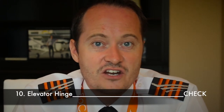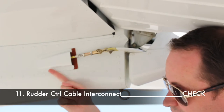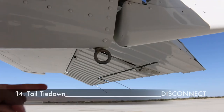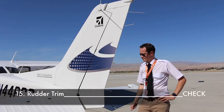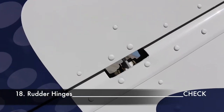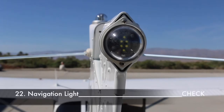Check the condition of the elevator hinge — verify a bolt and nut are present and the nut is secured. Look below the elevator to check the condition of the rudder control cable interconnect and the rudder and elevator steering horns; check for proper attachment of nuts and bolts. Ensure any tail tie down has been removed. Moving up the rudder, check the condition of the fixed rudder trim but do not touch it. Verify two static dischargers are present, ensure the rudder gust lock is removed, and check the rudder hinges. Check the general condition of the two VOR/glide slope antennas, the rudder horn balance, the red beacon light and the white navigation light.